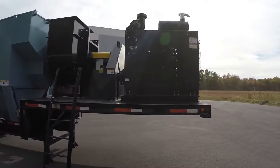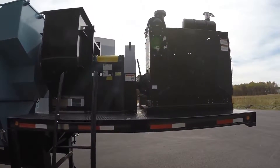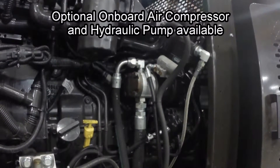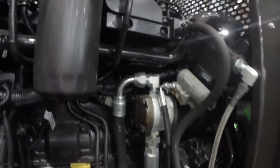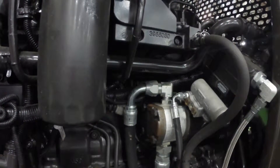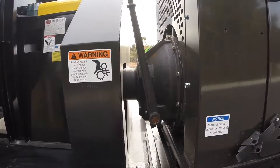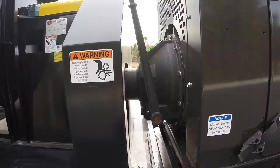First, the 160 horsepower Cummins diesel mounted on the front of the trailer. This engine is on a slide base to simplify adjusting tension on the belt drive from engine to fan. The optional air compressor is mounted directly on the engine to supply sufficient air to clean the filters while running without needing an outside air source. The hydraulic pump is also mounted directly to the engine for trouble-free power to drive the dust discharge auger. The easy-to-reach manual clutch engages the fan with ease and will last for years and years if properly maintained and adjusted.